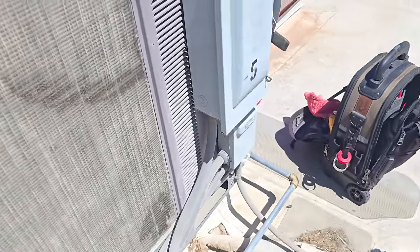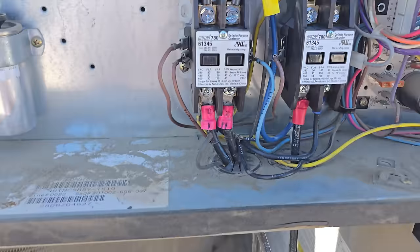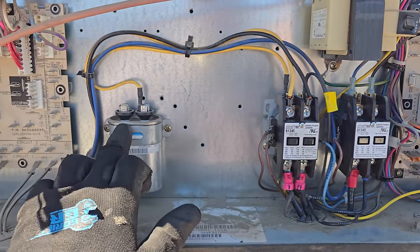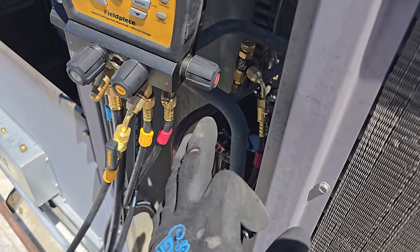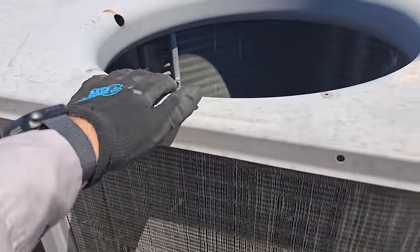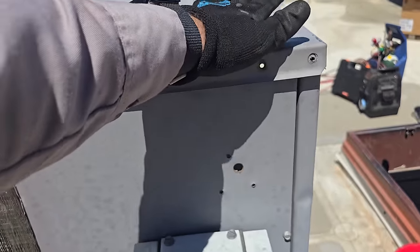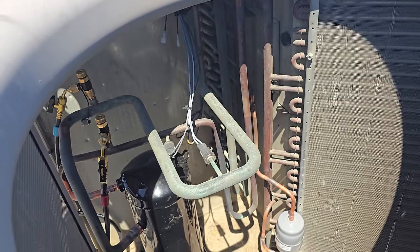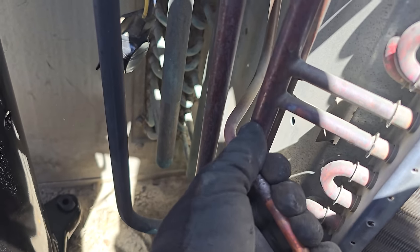I got the contactors replaced over here — both contactors replaced, new ones installed. Instead of doing the lugs, I just put a red connector, and that's it. We'll pull the condenser fan motor wiring back through and then put the top on — we'll probably take a lunch and let the vacuum finish running. We put the top on and we're assembling the condenser fan motor and all that. We can't source a crankcase heater right now, so I've just got connectors there that we can connect later. Everything's looking pretty good — the dryer's strapped and secured, and we've got to make sure the lines aren't going to rub out on anything.